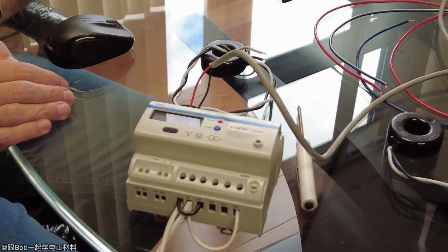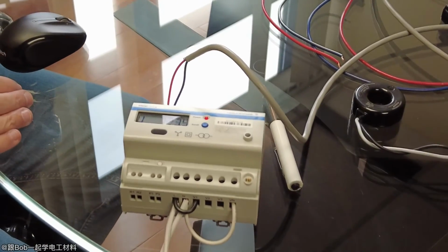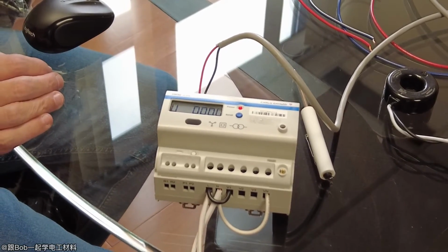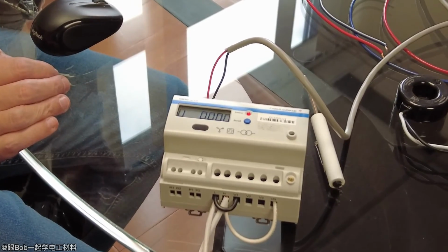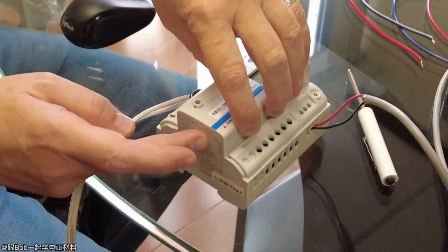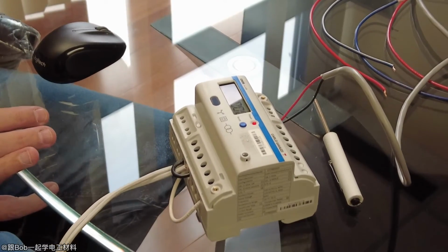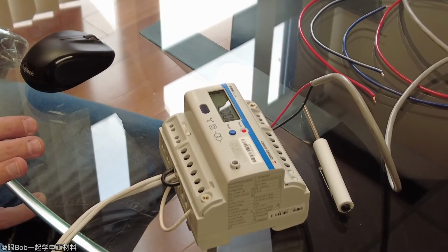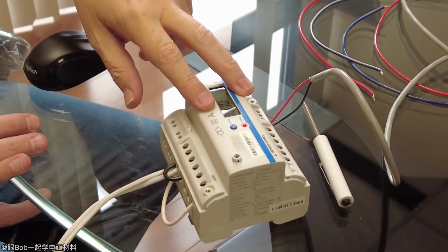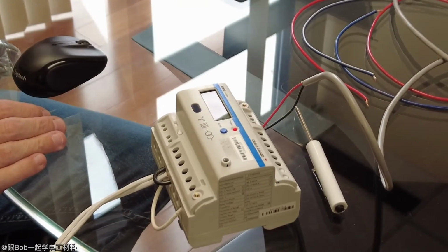I already read this EM50, 600 amp and 200 amp. All the model numbers start with EM50, but they're different meters. They're all basically the same. The Measurement Canada one is exactly like the other one, but since we got Measurement Canada approval on that, we have to put the Measurement Canada marking on it. In terms of function it's basically the same. There's one variable this one doesn't do that the non-Measurement Canada one does, but nobody uses it, so we standardize on the Measurement Canada version. If you want it sealed, we send it out and get the laboratory to put the seal on it, and then you get it back.